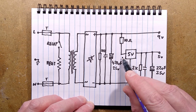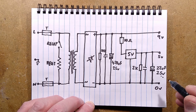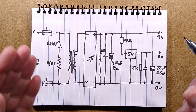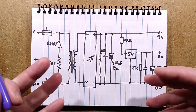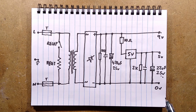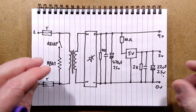There's a 10 ohm resistor feeding down to a 5V regulator, then a 2K discharge resistor, a small decoupling capacitor, and a 22 microfarad 25V capacitor. So you have 9V, 5V, and 0V out. These discharge resistors are because it's got a microcontroller — without them, the voltage can fall so slowly with the low load of the microcontroller that it can result in false or unstable resetting if power is reinstated before the voltage has dropped to the point where the processor has reset completely. It's easy to add in and ensures that when you turn it off, the voltage in these capacitors drops quickly and provides a nice clean reset.